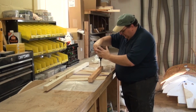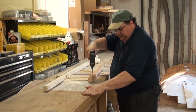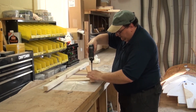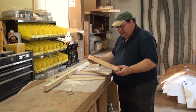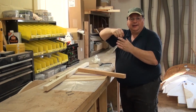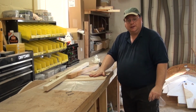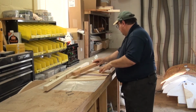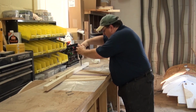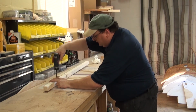And in order to do that, all I did was rip a 2x4 down in half and screw it right to the bench top. And before I did that, I put cellophane packing tape on there. Now, again, that's to keep this from getting glued to this, right? And I actually had 3 of them going across here. I've taken one out. All right, just take this one out and I can show you how we did the rest.